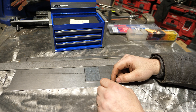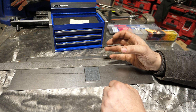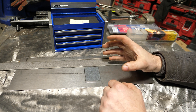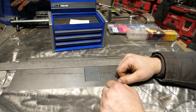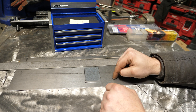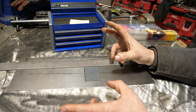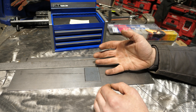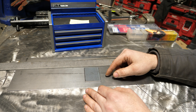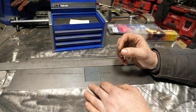Use 5/64ths rods, buy them on Amazon. Once you get a feel for it, you'll be able to do it. The best way to prepare and find the right settings is to run beads on the thinner material first until you've got a solid bead looking good, then up your amperage by about 5% and weld it to the 1/4". You need to understand what amperage the thinnest material needs first, then increase it slightly to get fusion to the thickest. The truth is, even with all the explanation, you're still going to fail a ton until you get a feel for it — it really comes down to practice.